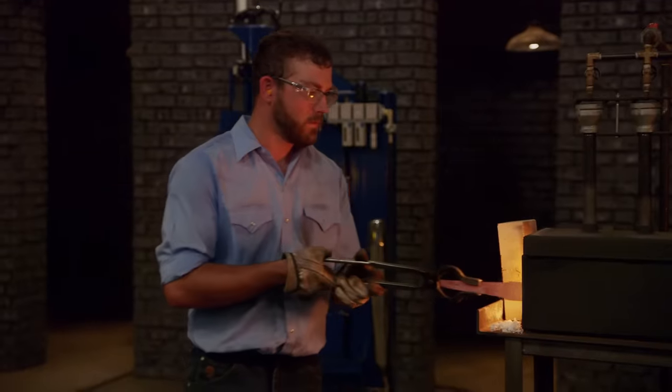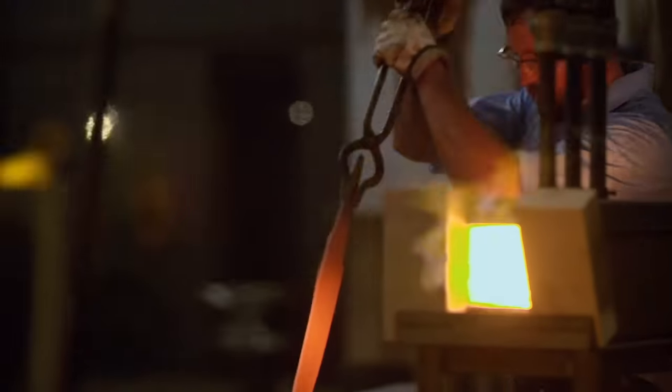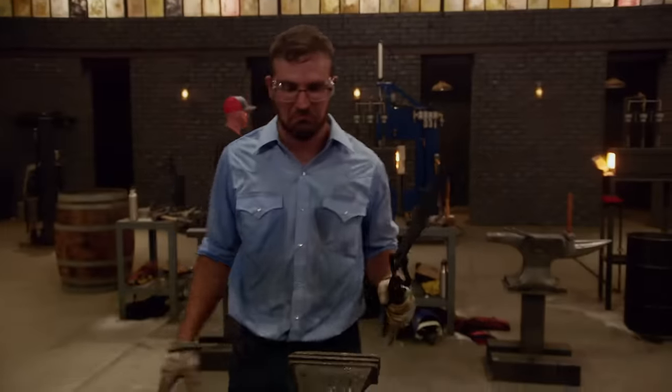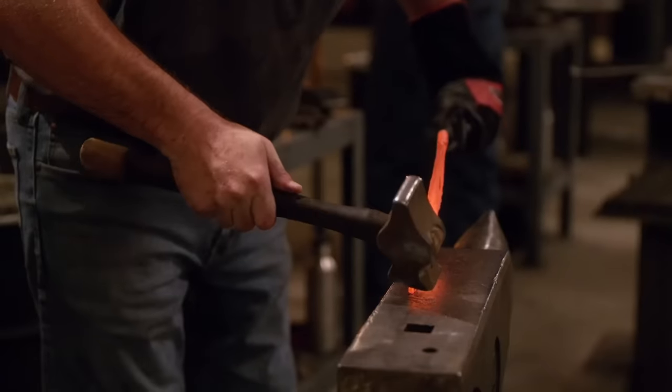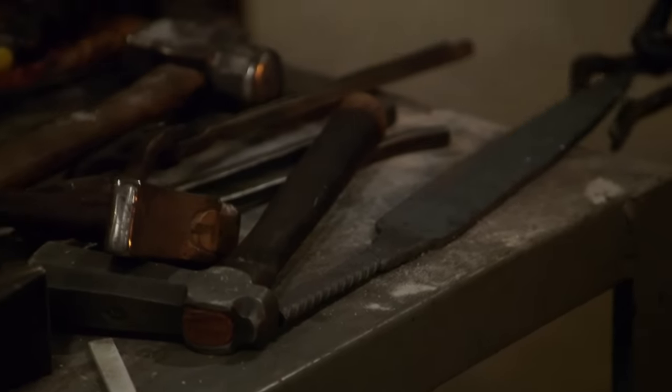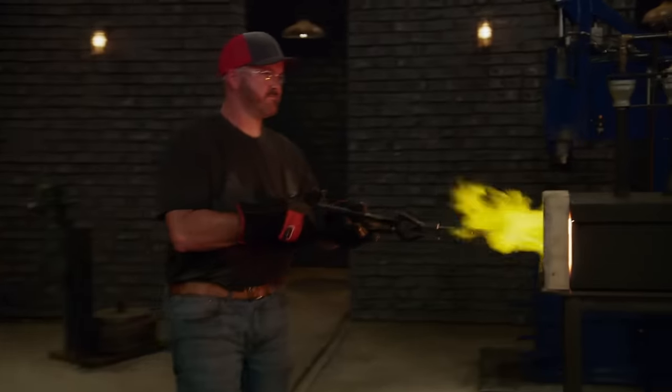The quench is vital, because if I don't have a strong blade — if it's not hard — it's just a piece of mild steel. There's no reason to continue this competition if I can't get that blade hard. As I draw it out, I realize I'm not going to have enough blade length. So I know I'm going to have to incorporate the rebar into the tang section to be able to meet parameters and have a handle. It looks like Mitch is going to use the work stick as his tang — rebar holds up skyscrapers, so that's a smart move.